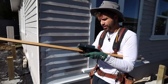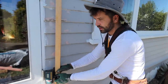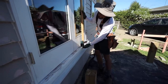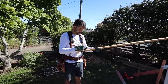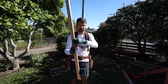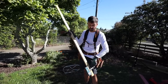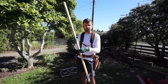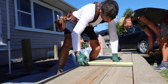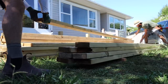This is my other laser, the Bosch one. I bought this a couple years ago and it's been really good. One of the things I like about it is it has the receiver. We're working our heights off the French door here — we want the top of our decking to be approximately here. So we know that the laser is set to the finished top of deck height, and we basically measure up in order to go down. We're going to work out the decking, the joist, and then the bearer, and measure from here up — that's where the laser receiver will go, giving us top of post. We've got varying degrees of width — sometimes it's the machining but often it's just moisture in the timber. We're going to pick an average. It's only a deck: 140 mils for the joist, and then the bearers underneath are going to be bigger.